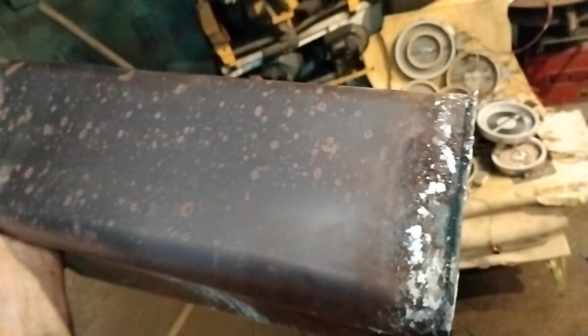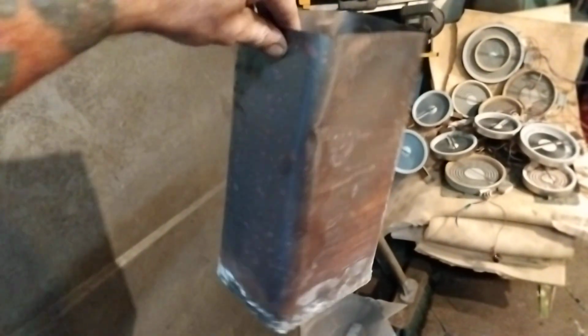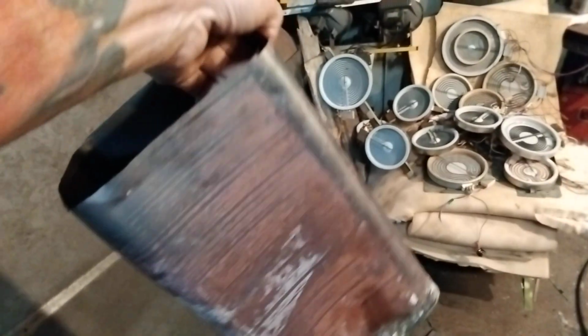Now these are only good for one use, because as you can see, if you try using them twice, when the steel cools, it basically starts flaking and it gets thin, but it's okay while it's glowing. So you can use it once, you can fill about, well, works out 16 kilos, but I don't know how that's 16 kilos. So I'm going to work this out in litres. This would give me 4 litres of liquid aluminium.